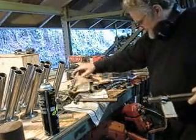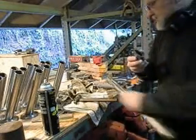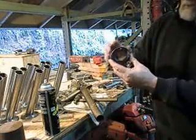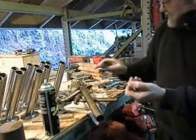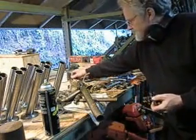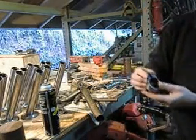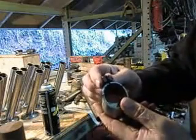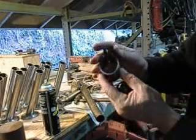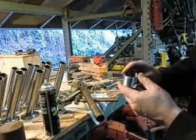Really, the job here — if you'll look — is that I want to weld the little cap to this, but this has got to be able to spring. Let me grab one that's already been done that's not hot, and you can see that this springs just a little bit. Basically, this is going to create a clamp, so it'll clamp around the tubes and hold it in place once it's there.